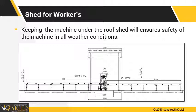Entry chairs are brackets made by bending the bars available at the site. They help to rest the bars and guide them, making the cutting operation quite easy. This ensures that the bars do not bend while they are measured and at the time of cutting. The entry chairs are placed on the opposite side of the hand lever. Similarly, exit chairs help keep the bars after cutting, making it easier for bundling and dispatching for construction. The chairs should be positioned lower than the cutting height of the machine and placed on the same side as the hand lever.